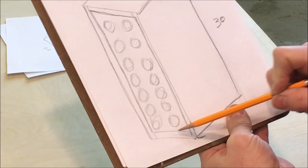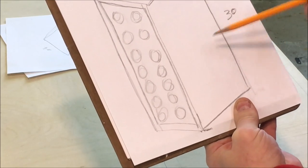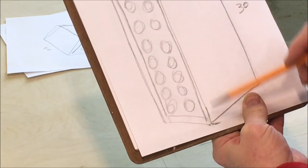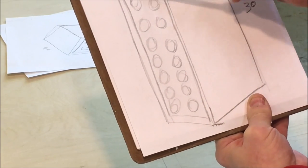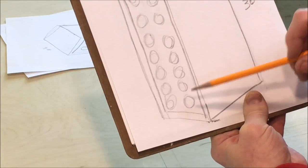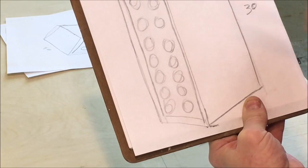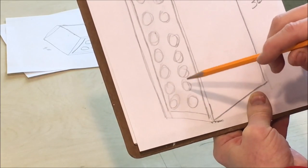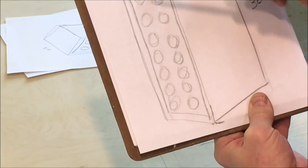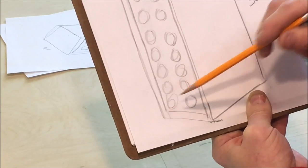It's going to be a very simple frameless cabinet: 11 and 3/4 deep, 11 wide, and 30 high. Just birch plywood. Going to make some edge banding for the front, and came up with a design of simple holes drilled in here. I was first thinking about a diamond pattern but the openings were too small, so I came up with this. Looking at pictures of wine racks, this was the best idea — and actually I can get more bottles this way: a diamond pattern gets about 12 bottles, but this gets about 14.